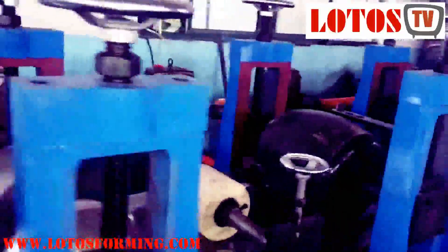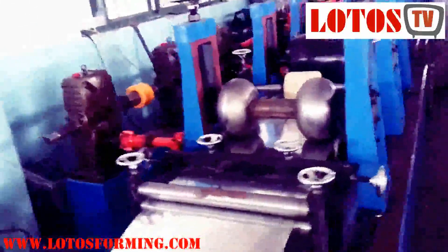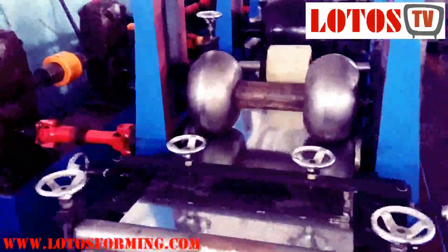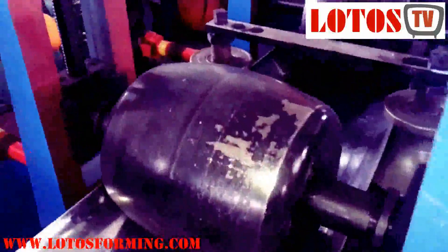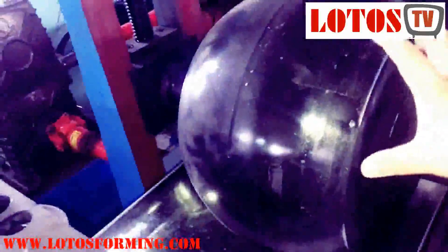This line is bigger than the first one. The pipe diameter is up to 180 millimeters. The input roller design is different — it is much wider. The rollers step by step are different. The bottom roller makes the edge curve, and the upper roller makes the shape deeper. This roller is longer and narrower to adapt to different depths and widths.